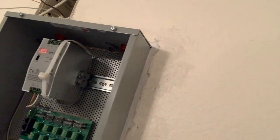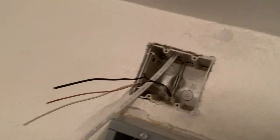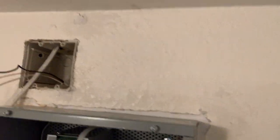This box is about 13 and a half inches. It was wonderful. They stuck a stud instead of 16 on center, they did it at 13. So I had to chisel out a half inch of that stud and then mud that. He'll just get a guy to texture it, but I mudded all of it so it could dry, or he could just possibly just paint it.